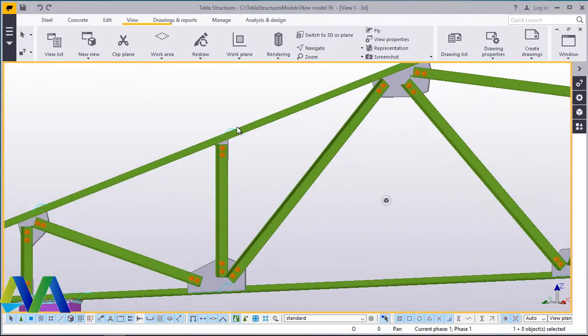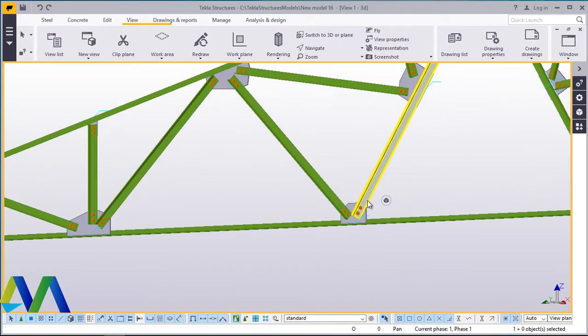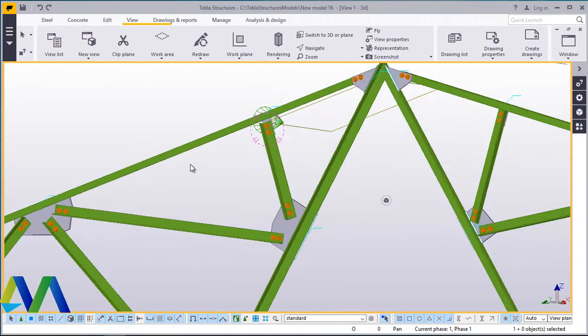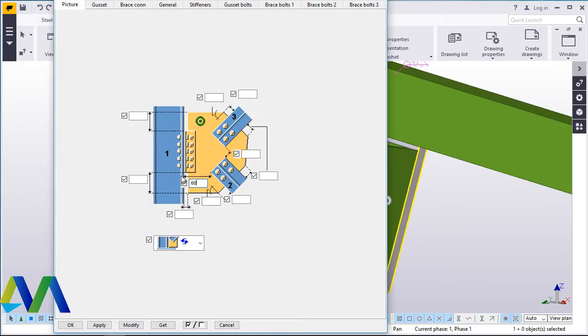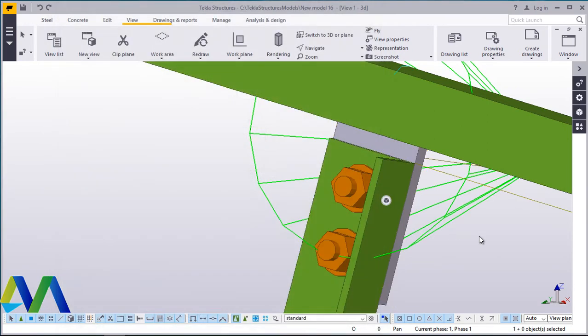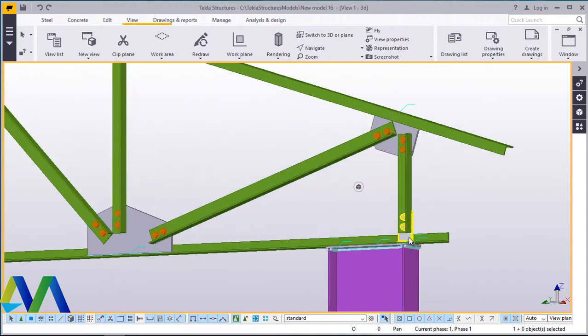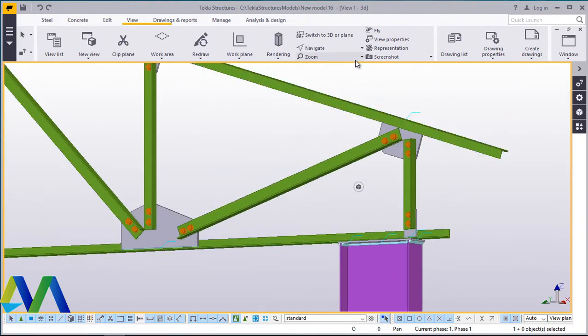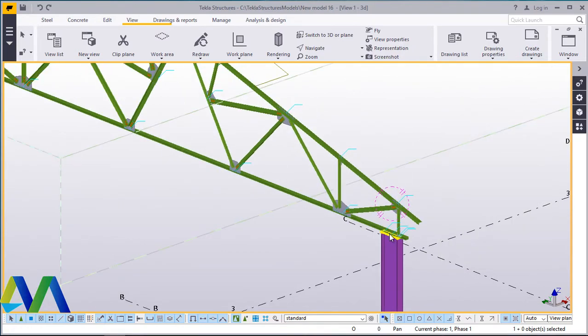Do the same thing. If you get a point where the strut is clashing with either of these chords, top and bottom, you need to readjust that by doing the same thing I've done here on that connection. We'll do the same here. Just double click on the joint, then come here and change this to 60. Apply and accept. You see, there's a change there. Just walk around your truss and check for anything you feel is not professionally done or not right for you. Every drawing is customizable to what the client wants. Now I'll right click and interrupt that.